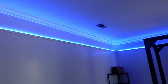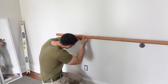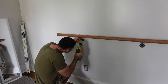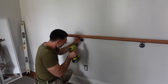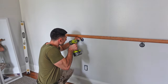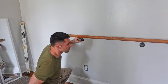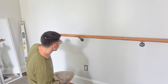I now only have two major things left to do to the room. The first is to install this balance bar. The brackets are black — the same color as the dumbbells, painted at the same time — and I stained the bar itself. To install the bar I need to make sure the two end brackets go into a stud. The easiest way was to put them into the studs where the outlets are, which also happened to essentially center the bar on the wall. For the middle bracket I measured the distance between the two end brackets, divided it in half to find center, and placed it there — and I luckily hit a stud too, so all three brackets are stud-mounted.